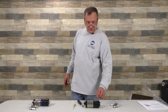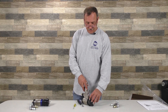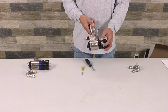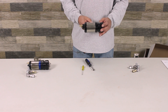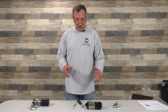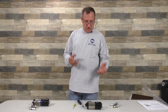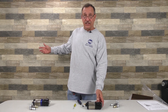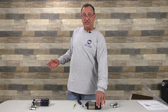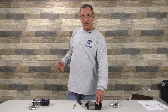If you do have a crossover, the purpose of the check valves is to keep the material from going into your hose, so make sure you have these in when you spray. I also recommend screens because the little ports on your mixing chamber — the impinging ports — are small, and if you get anything in there you will have crossover. If you have off ratio on your machine and you're getting the E24, look at the high side of the machine — that's the side you want to check the screens, because that's where the restriction is.